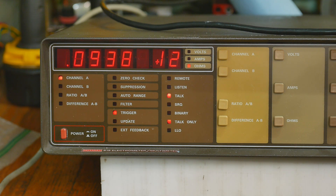It's been about two minutes and it's at 93.8 gigaohms, and it does seem to be rising, although very very slowly. So I might just not know how to use this instrument yet, or the settling times for these high-level measurements just might be like 10 minutes for very high numbers. I do believe it keeps going up. The resistor is 5%, so if it was 95 gigaohms it would be within spec. I think we're getting close to what the resistor really is — probably a little bit on the low side. I was able to measure 100 gigaohms.